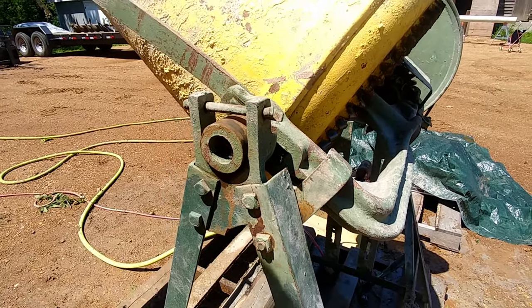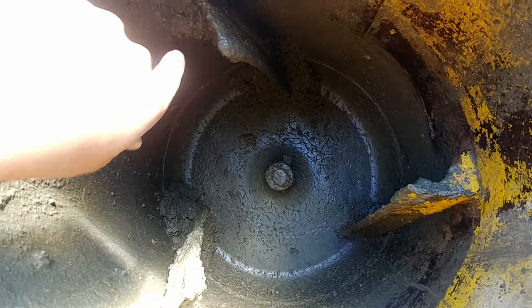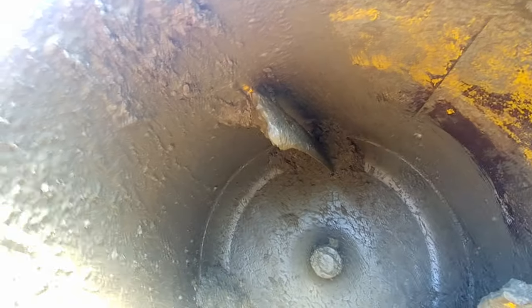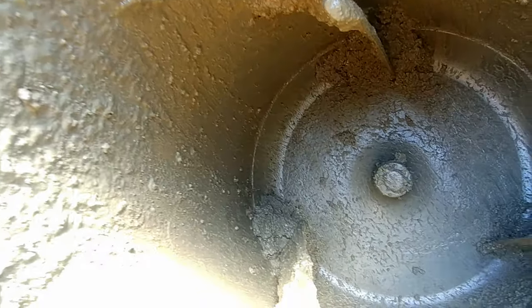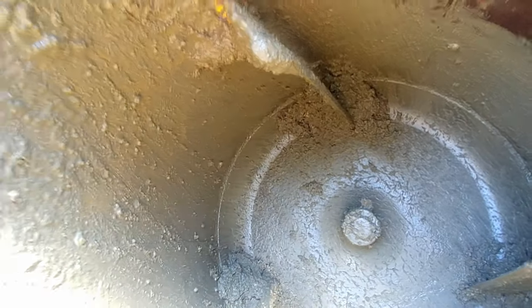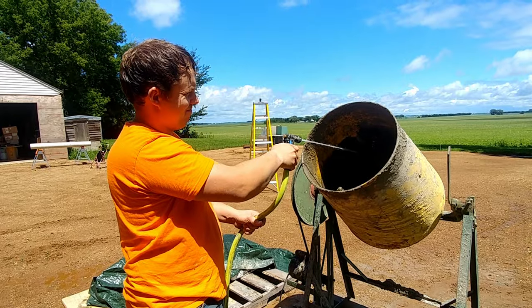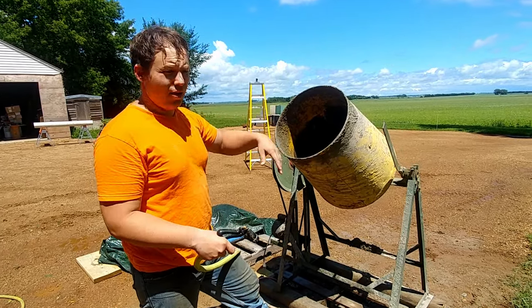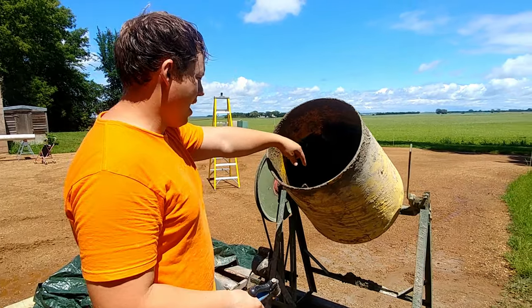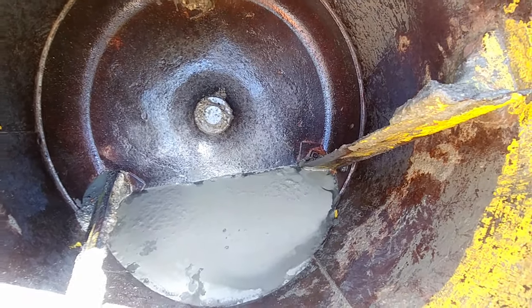When it's latched right there, it's in the mixing position. You can see that we've got a little bit of leftover cement that's clumped up in the edges. So what we're going to do is just spray that down before we add our new bags. Once you get it rinsed out, you'll see down in here that we have a little bit of water down in this corner. Now if this is the first couple of batches that you're doing, you might want to measure it, but you'll kind of get the hang of it as time goes on.